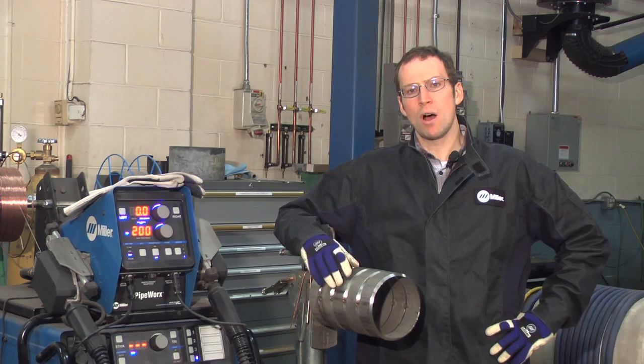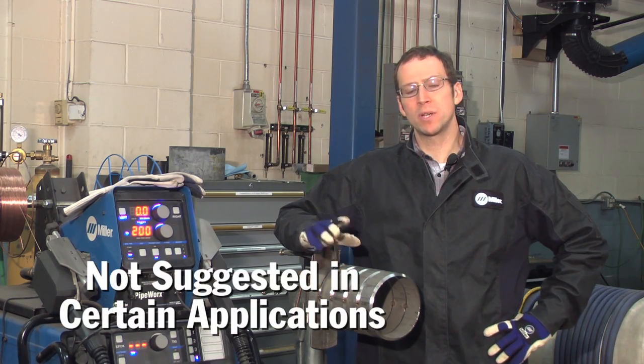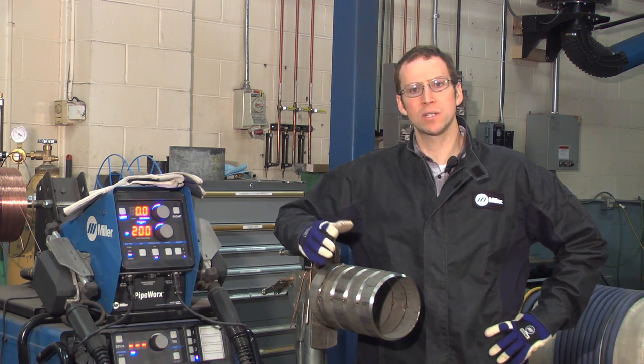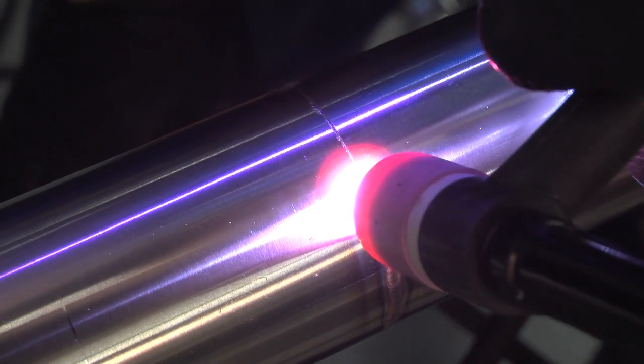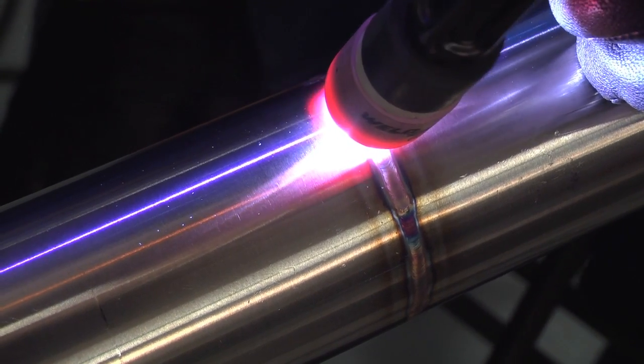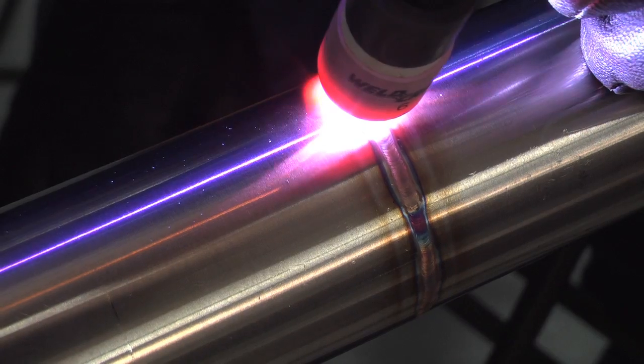As you can see here, we were able to make the weld without any oxides forming on the back side of the joint. Although this method for welding stainless steel pipe and tubing is widely accepted in the power generation and petrochemical industries, it would not be acceptable in food grade or very high purity applications — there, a TIG root with a back purge is considered the industry standard.